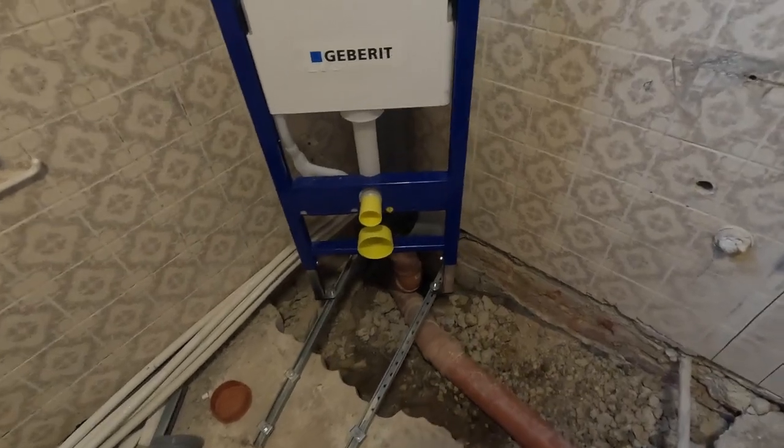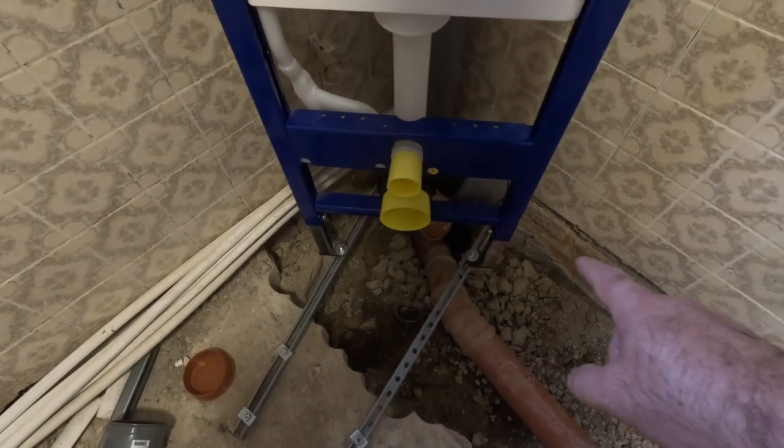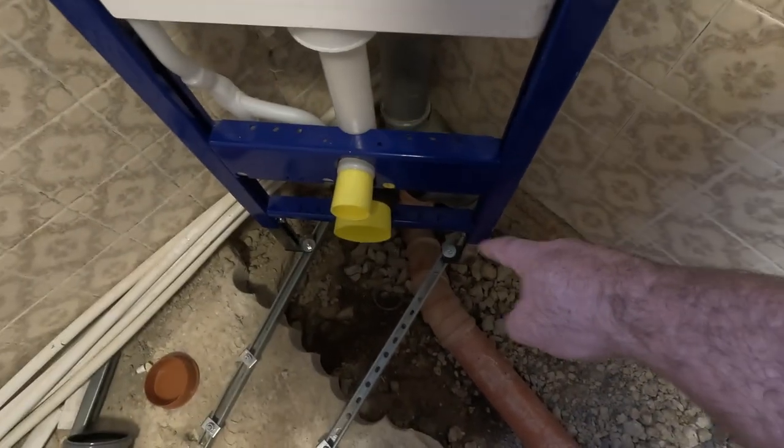And what I think we're going to end up doing is, once the cement is level with the Unistrut, I will cut the Unistrut at the front. That's more so we have the largest thickness for the floor leveling that's going to go in. We're going to level it with this stuff that almost looks like chocolate milk when you're putting it in. And it hardens. It's like a paper pulp, cement, and sand mix. It's a fluid floor leveling compound that they're going to put in, and it's going to be like this thick. And then we get to do floors.